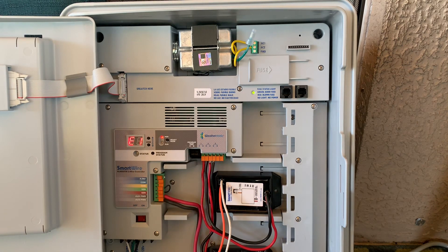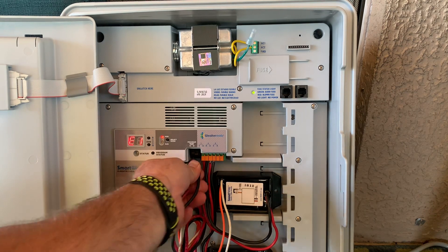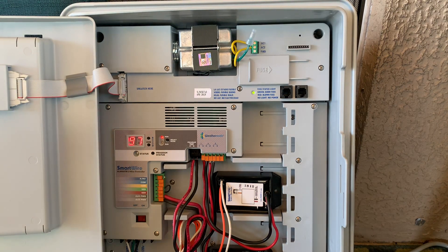I'm going to now take this one off and we're going to program a zone valve — let's say zone three. This one may already be addressed; we'll find out here in a second. Okay, so this one is addressed as master valve one.